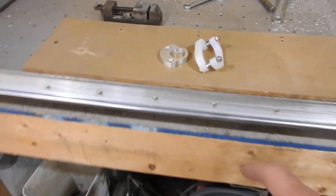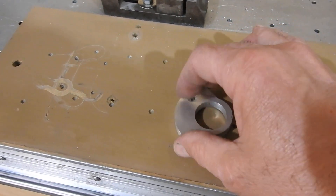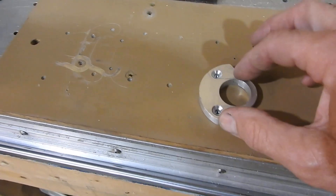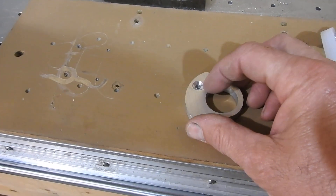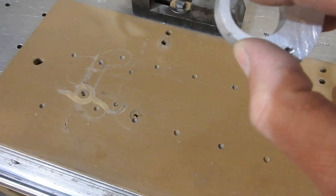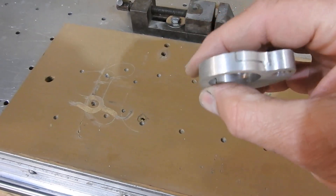That's pretty much all I was able to get accomplished this weekend. The end mill for cutting out this little pocket didn't show up until after 12 o'clock Saturday, so I wasn't able to make these pieces until the afternoon. The smaller ones I was able to cut out just fine. The first one I did didn't want to go in — I had to do a lot of fine sanding on this piece to get it to the mating surface. So I adjusted the cut program and enlarged this passage a little bit. The next one fit really good. The only one that didn't fit was still a little tight on the corners, so it took some massaging to get them in. Then I just put them on sandpaper and sanded them nice and smooth, and they overlapped just right.